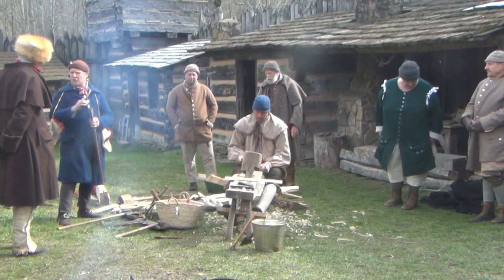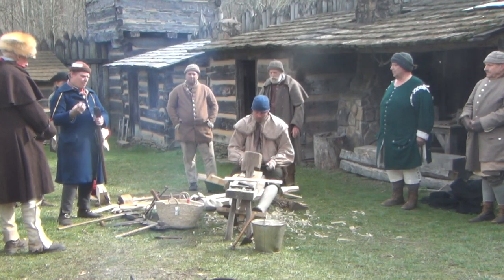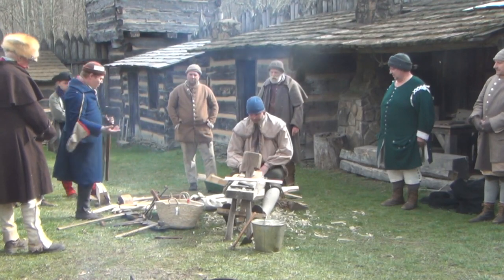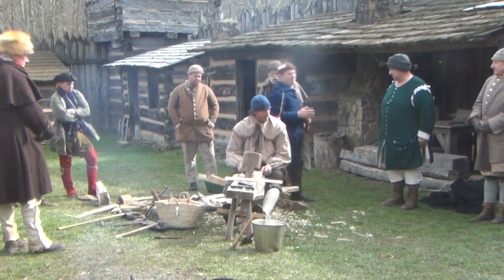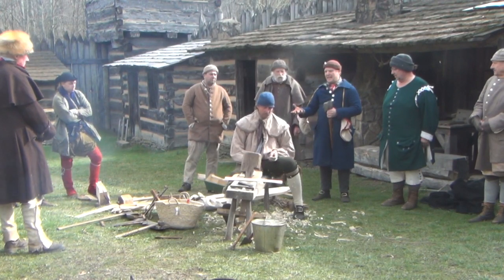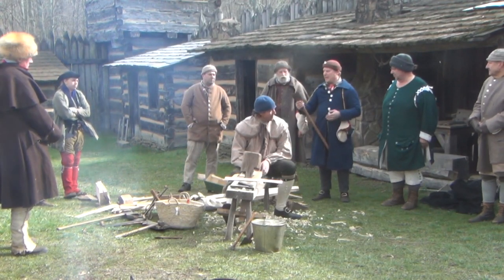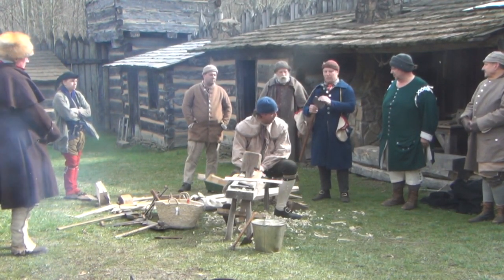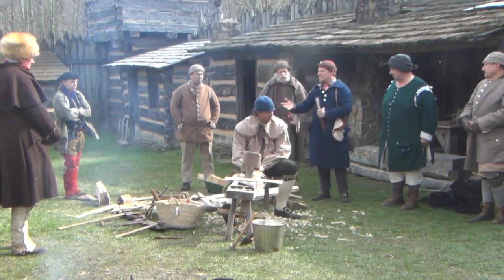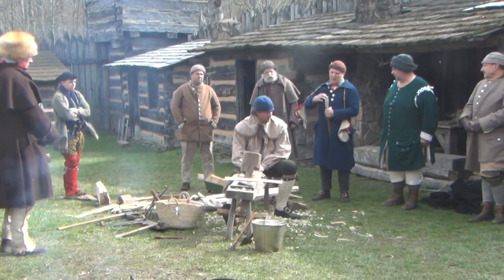When you work them, you want wood that's dried and seasoned, so that the expansion and contraction of fibers is reduced the most. And then from there, as you care for your tool and where you use it, what happens to it from there? An outdoor environment like this is pretty damp, but we don't have temperature extremes. This axe has been in my garage for about a year, right by my wood stove. So what's going to happen to that wood? Yeah, it's going to shrink and contract, of course. If it wasn't next to that heat source, it'd be a lot more stable. It would have that humidity that would work into it.